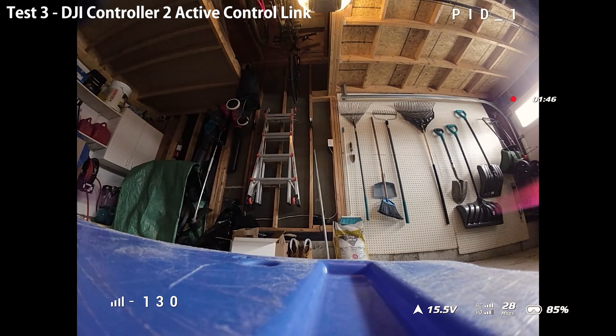As you can see, I'm walking away. Megabits are dropping. HD signal is coming down. RC signal still shows four bars. It continues to go down. We can see RC link is still showing four bars, which proves how unreliable that particular indicator is. We're down to nine megabits, so we should be getting to the end of the usable signal. And we're seeing RX loss — this thing is about to failsafe, and it failsafes.